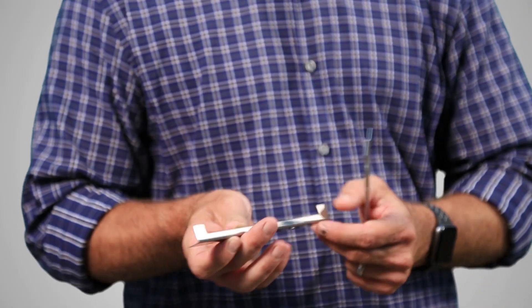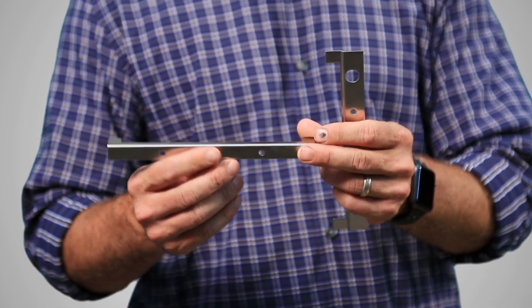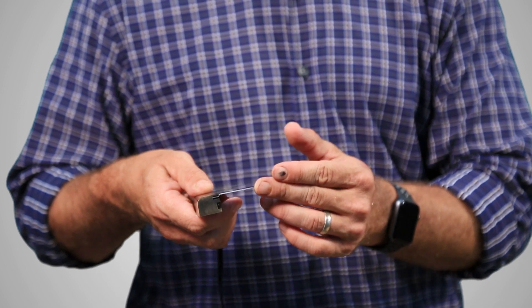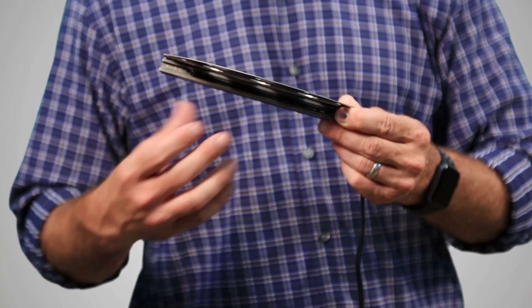The other two brackets are a little bit different. Sometimes you come into applications where you have an existing wall, so this is a surface mount. This is used a lot on wood stairs where it's just a little difficult to fit a larger bracket in. It could also be used on an existing seating wall where we have access to the back to feed the wire through. And then this bracket can go in new or old construction — it's smaller. There are just applications where the bigger bracket can sometimes get in the way. One thing you notice different about this bracket is it has a curved shape. This came from one of our installers who said they'd love to have it match the shape of the grinding tool they use — a seven-and-a-half inch grinding tool. So they're able to simply grind out a mortar joint, put the fixture in there, and lock it into place. All these brackets are designed to last forever, and the fixture hides the bracket inside so it's very discreet, very hidden, and looks beautiful.